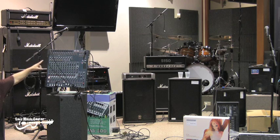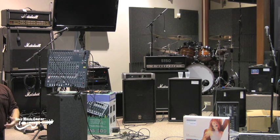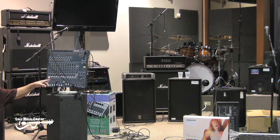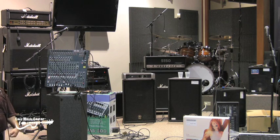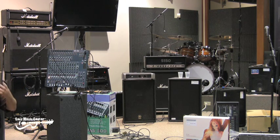We added these compressors to the mixing. It's off now — it's obviously the full range, the dynamic range. I'm going to start squeezing it. You'll notice it seems louder, so I'll turn it down a little. But notice that the level doesn't change much as I pull the microphone away. If I get on it really hard and start really getting on it, it gets a little louder but it isn't near as loud as I was. The more compression, the more squeeze that I put on it, the less of a level change when I really use my voice or I whisper. Notice — level's almost the same. This is handy especially if you've got blues singers who have whispery voices and they can really belt it out when they want to. This way, your sound system is never going to clip or run out of gas.